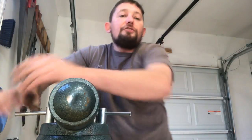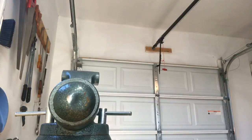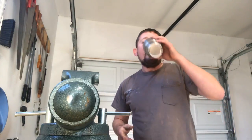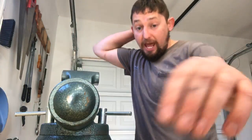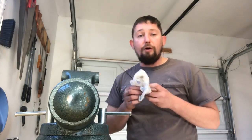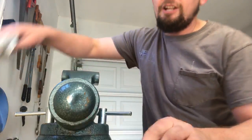And I have no problem showing the techniques I use on my harps. Everything except for my tempering, my heat treating part right now. It helps with the finish, helps it remain corrosion free, and it also changes the Rockwell hardness of my reeds a little bit and closes my gaps.